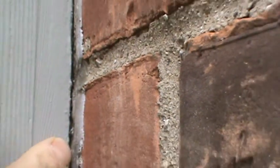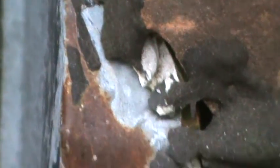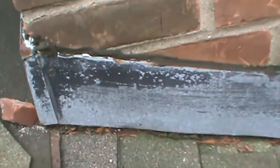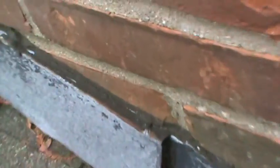All up and down here, when you get down to the base flashings, these right here need to be re-caulked. The caulking is getting really old — it's open, you can see there are holes in it; it's just tar and it's not really there, getting rust. So all the flashings need to be re-caulked. Right down this seam here should be reloaded with fresh caulk — it's splitting away, it's opened up, and water gets right in that area.